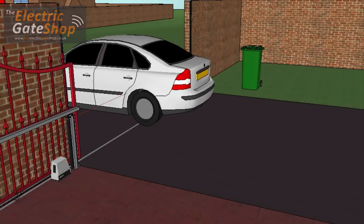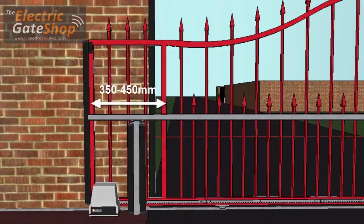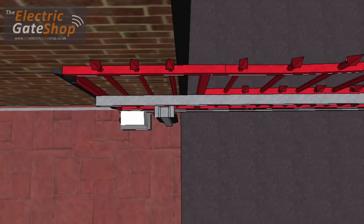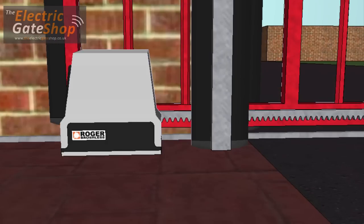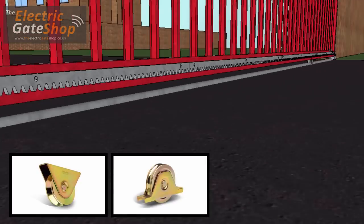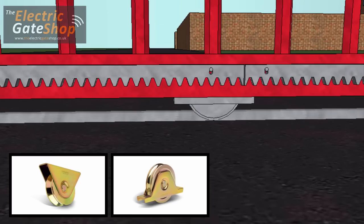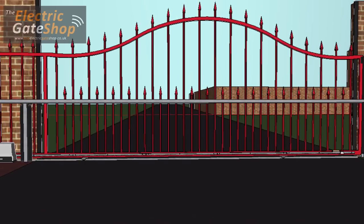Using a floor track, the sliding gate's length should be approximately 350 to 450 mm wider than the width of the opening. This allows room to position the motor behind the wall, away from the opening and support post. Gate rollers are fitted to the bottom of the gate. These are available in surface type that bolt onto the bottom of the gate, and countersunk that are inset into the bottom bar of the gate. Generally, countersunk rollers are more aesthetically pleasing as they allow the gate to be lower to the ground.